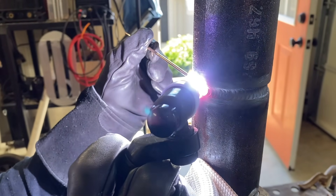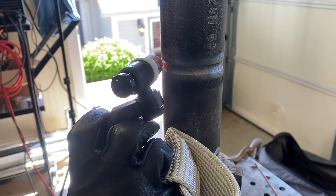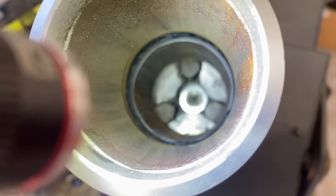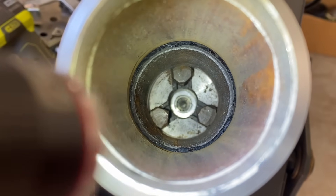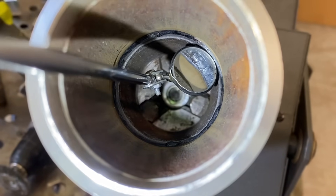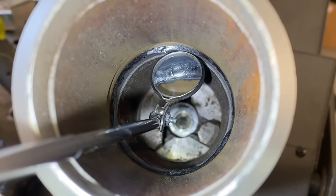This is my good friend Andrew Carden doing the welding today, and I'm running the camera. Andrew came for a visit and we were able to film a few videos — some aluminum, a 5F aluminum tube to plate, a 5F 7018 tube to plate, a 6G test like this, and some more. Here's the root pass. When I worked for the Boilermakers in a fab shop, this is about what they wanted — they didn't want a lot of reinforcement on the inside. In fact, they would blow a ball through these joints to make sure you didn't have too much. This is above flush, tied in — this is what they wanted.